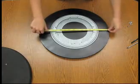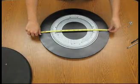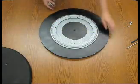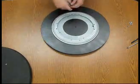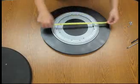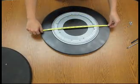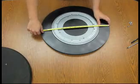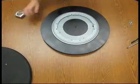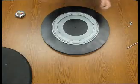You will first need to measure the bearing and measure your base plate so that you can properly center the bearing on your base plate so that you can mark the holes that you're going to pre-drill for mounting. Be very careful with your measuring. Make sure you do center the bearing properly.